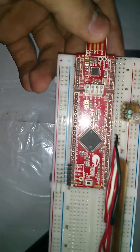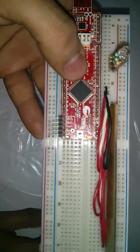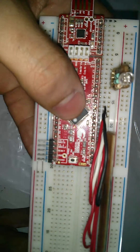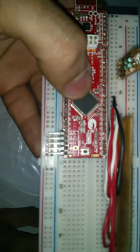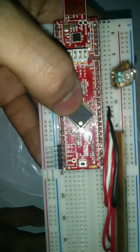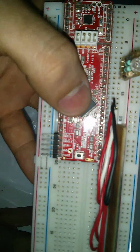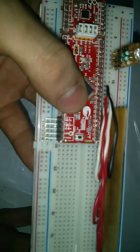Today I'm using this particular chip. One interesting feature that Cypress gives with each of these chips is that they have an inbuilt CapSense module, basically. So you can actually go ahead and use the pins as generic capacitive touch IO. I have hand-drawn and etched this custom board.